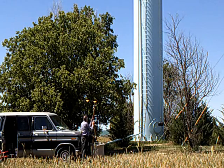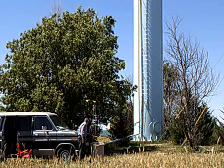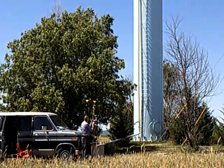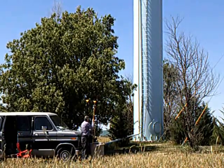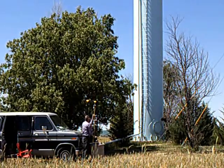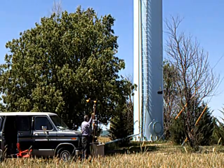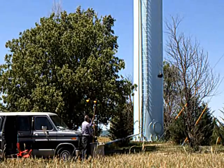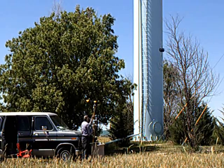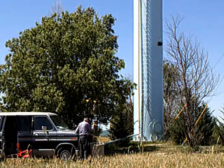The motor speed controller is programmable and only takes a few seconds. In this segment the maximum speed is 60 feet per minute instead of 100. The acceleration and deceleration rates have been reprogrammed and are now at two and a half seconds instead of five. Programming is also available to stop the machine if the load becomes snagged or if the line becomes slack. You can even connect it to a computer for almost endless possibilities.